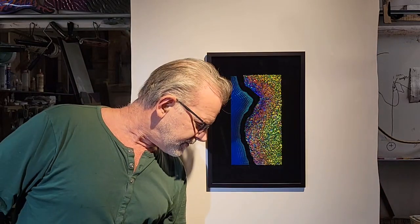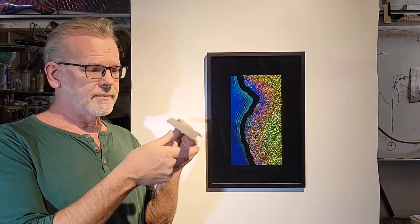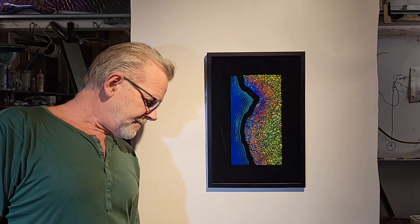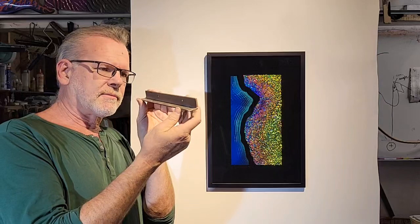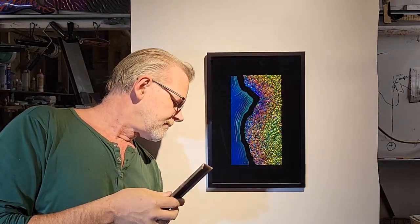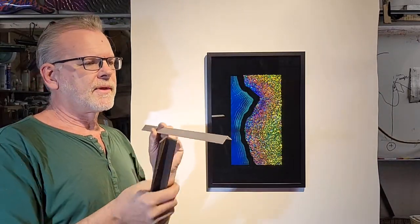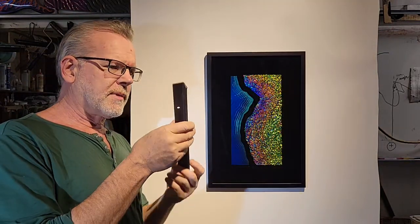What I've done in the past is figure out inexpensive ways to make the beveling jig — you can make it out of aluminum z-bar like in the next slide. But today I wanted to make one that would be easy to get material for. This is simple steel angle. I'm using the angle because I want to be able to hold the pieces on with a magnet. If you did one out of just aluminum, you'd put a lip on it and could glue steel to it for magnets — but this is the method we're using.